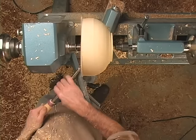Okay, it's really important to understand where to hold the tool when I grind. I will not hold the handle because if I held the handle, I'd have a temptation to lift the tool up without noticing it, and that would change my bevel angle. So I'll hold the tool above the ferrule here and have both hands above the handle. Now, I'm going to lay the tool flat on the rest, and I'll bring it up to meet the sweep here all the way across, and I consistently hold the tool against the platform. That way I have a consistent bevel all the way across. Now it does require a steady hand in order to make this happen. That's a little bit of practice and perseverance on your part.